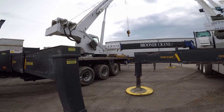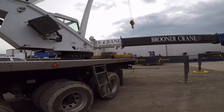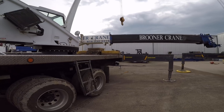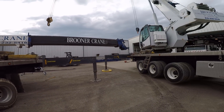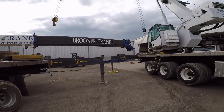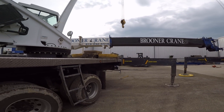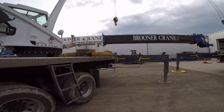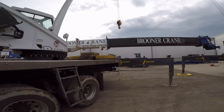So that's our 100 ton, the ATF 80-4. It developed a hydraulic leak in the back of the telescope cylinder. The only way to get to it is to take the boom out. So we're going to yank the pack out — the telescope section of the pack. All five sections are going to come out the end of the boom at one time. We're going to set it off on the ground and then pull the telescope cylinder out and put new o-rings and seals on everything.